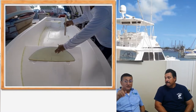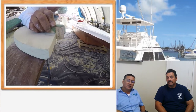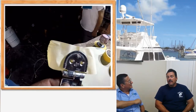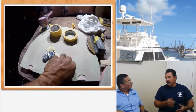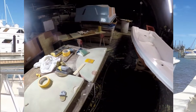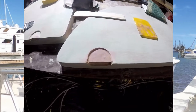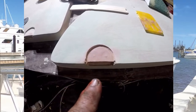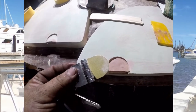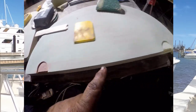I am impressed by how important this plug is just to create the hatches, and how important the angle is. You can see in the video on screen now that he creates a pattern to check that the angle is equal. We actually use a hinge as a template. You'll see in the video we put a wire because we want the exact space. When that was sanded, we're making the form, and we're going to show you how there are a lot of imperfections, and then we're going to make it look perfect. Here's the hinge — he uses sandpaper on the hinge to do the sanding so it's perfect, and then he'll do the edges. We're going to watch him duplicate that over here.